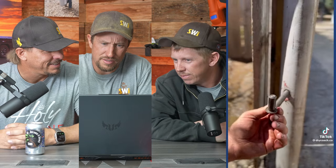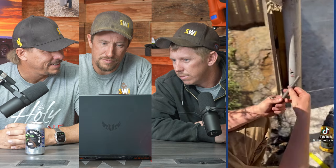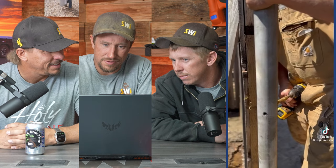First stop was the metal store to get the hardware. You always know it's good to grease the tip before putting it in. Installation time — and she's in. When I buy these cattle gates, I always upgrade the bolts. Here we got grade 8 steel, which we're going to have bolted on each side and tack welded in place. This step bit is ideal for drilling the holes, but ours was super dull, so adjustments were made.